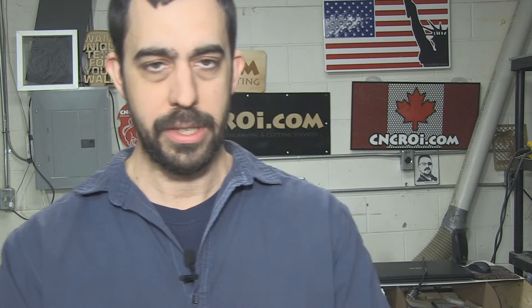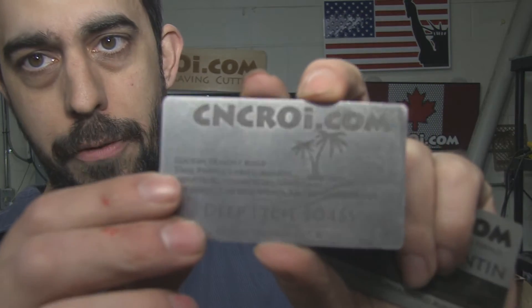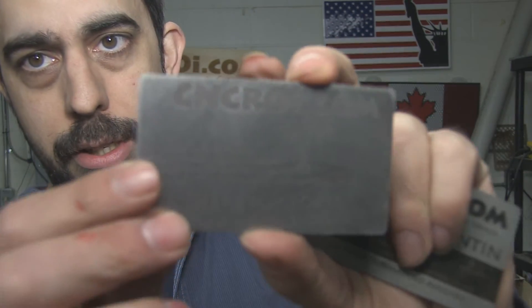What we do again as another process is sand off the surface to remove the matte and produce a nice brush finish on the etched stainless steel tag.